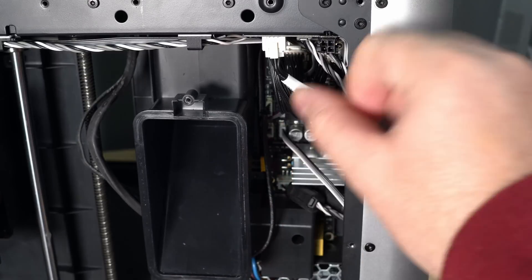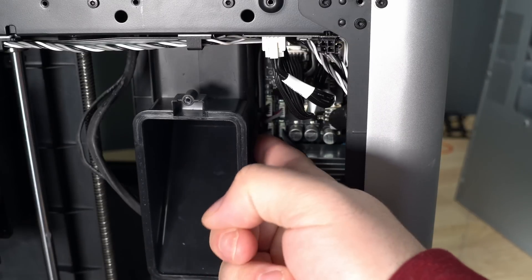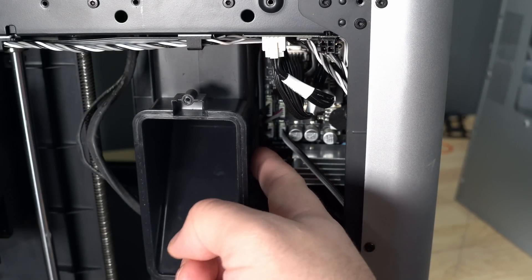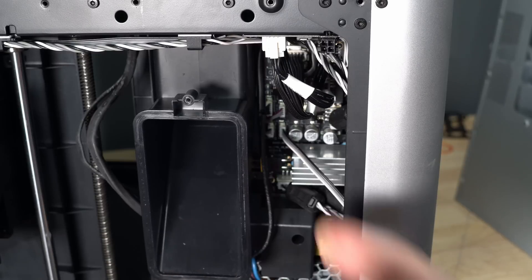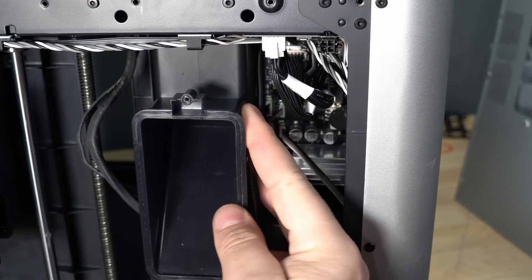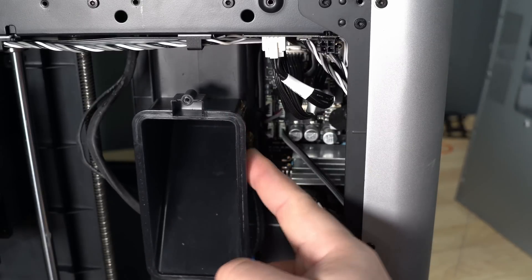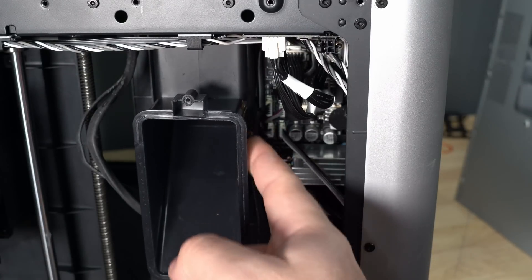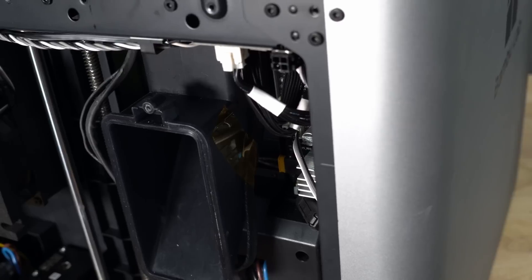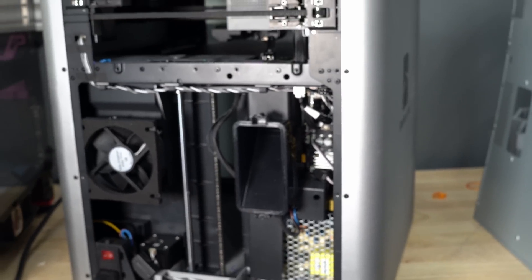You may also be able to put some hot glue or silicone glue on the connector itself to lock everything into place. But a little piece of tape works well enough and it's easily undoable. I'm going to put the piece of tape back on and close the printer back up. I'm using Kapton tape simply because this is an electrical environment and I like using Kapton tape anytime there's a potential for exposure to voltages or high temperature — though electrical tape or duct tape would probably work too. All I did was tape the wire to the poop chute for the filament, and that's it. Now we just screw the panel back on and we're good to go.